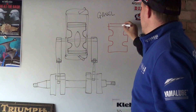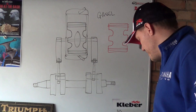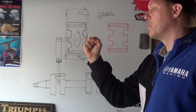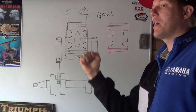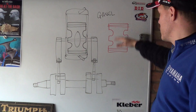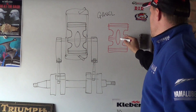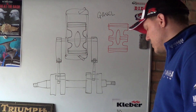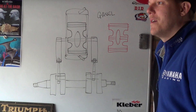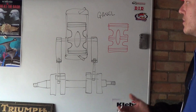The whole point of this idea was to not waste the travel of the piston. Obviously in a two-stroke - and this is a two-stroke design - you've got bang and the piston is pushed down, and then it's got to come back up. And that's wasted travel. It's a wasted stroke. So in a sense, I used to joke and call this the one-stroke. It's not a one-stroke, but there's a power stroke every stroke just with the same piston.